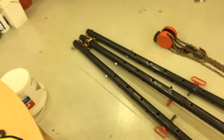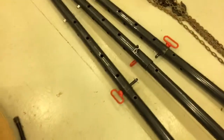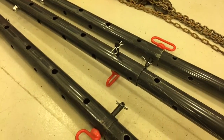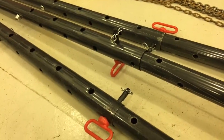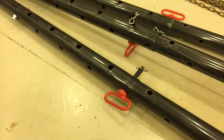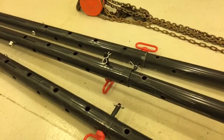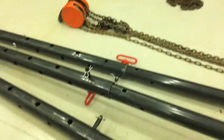We're assembled and ready to lift on its own legs. I've got the three hitch pins put in. I face the center one perpendicular to the other two, so that when in the upright position each leg's handle points outward — which I can use as a handle and also to run chain through it to keep the legs from splaying.